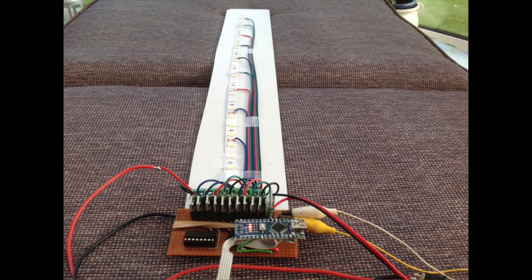And the test bed was basically 30 LEDs, split into 3, which is obviously the 3 for the 12 volt. Just cut the negative track, soldered it onto the other side. The live runs all the way through. And that was it, really. So that's ready to now switch on. So let's have a look and see what happens. I know what happens because I did it, but let's show you what happens.